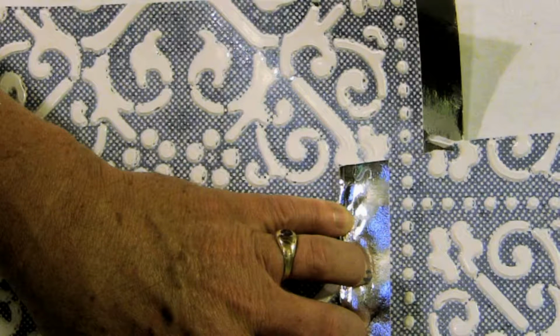Other candidates for double cutting on the wall that you never can do as well are metallics, foils. They just do not butt. You need a perfect butt, and the only way you can get a perfect butt is with a double cut. But as I say, with the boga strip, you got to protect the wall. Otherwise, that perfect seam is going to look terrible in about 6 months to a year.